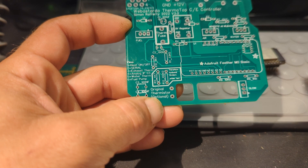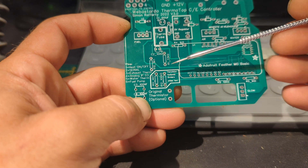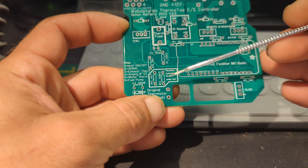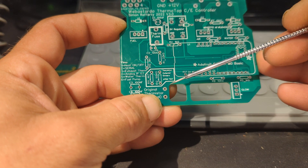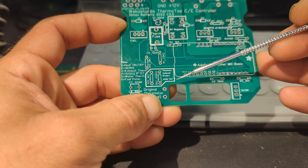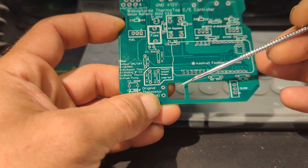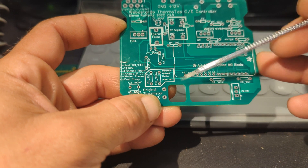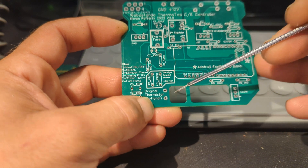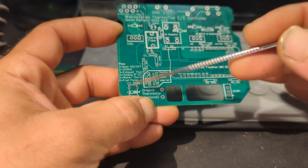The code uses the exhaust temperature to go into burn mode 2, which is running from startup, and it gives you 80 seconds to raise the temperature — in David's code he's got it set to 15 degrees. I tried going as low as one degree in 80 seconds and that was still struggling to find a difference. It's just not good enough for the code, so I've taken that back out of my board.